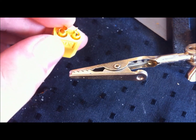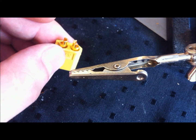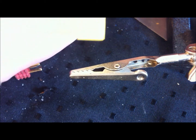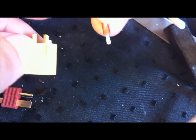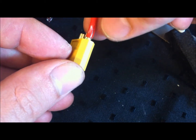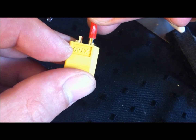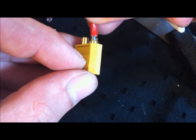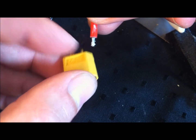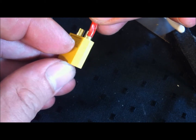It is actually a lot like soldering bullet connectors. The only thing you should be aware of is the wire that you need to put into the plug. It should go in directly — as you can see, it shouldn't be going in at an angle, because then you will have some exposed wire on the side. So make sure that you pre-tin the wire and the length is right so it actually goes into the cup of the connector.